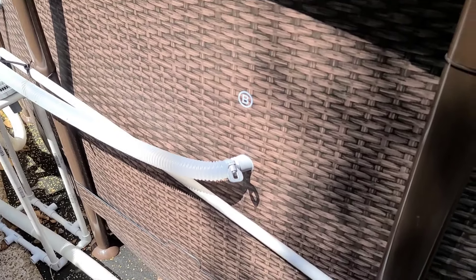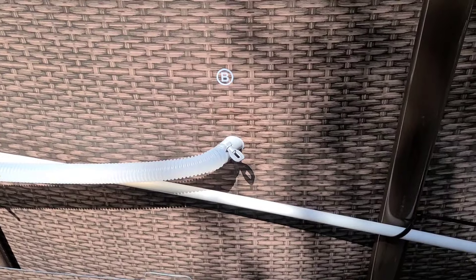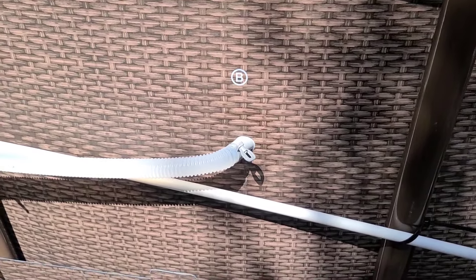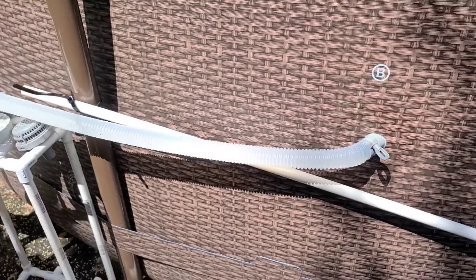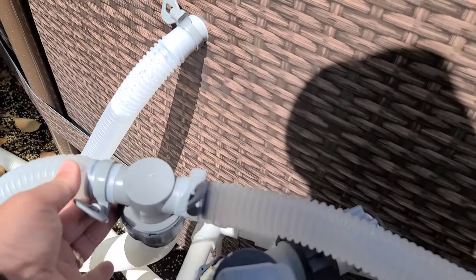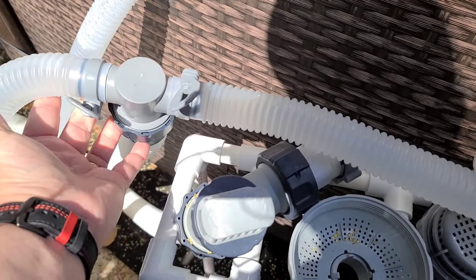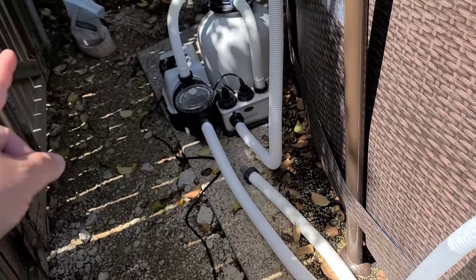The pool did come with one and a quarter inch outlets — actually I guess they're called inlets — into the filter. It came with these one and a quarter inch inlets which were to be teed into this particular T-junction, which has two one and a quarter inch inlets down to a one and a half inch connection to the actual pump.